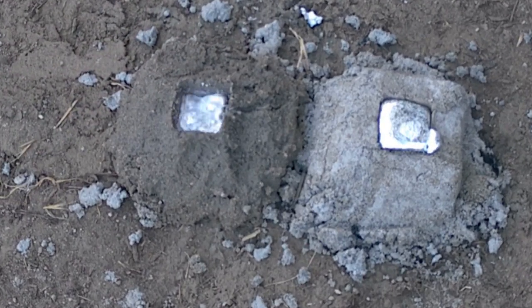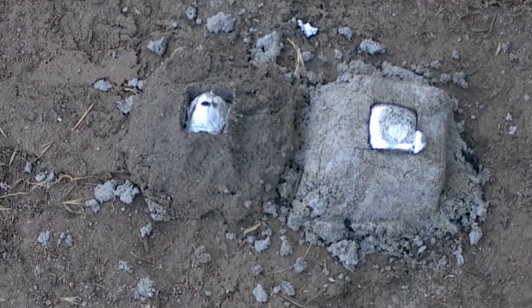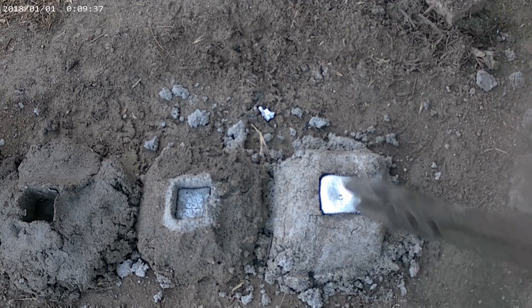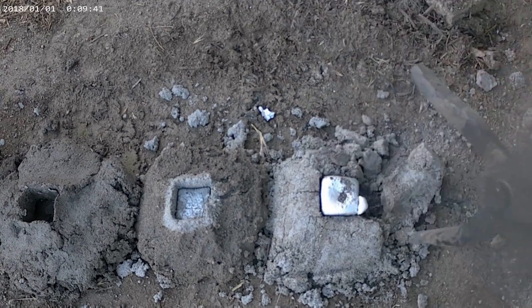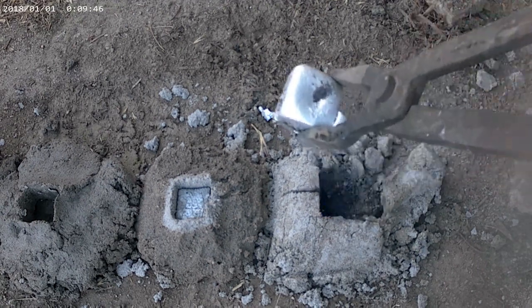Because it's such a heavy clay mixture, it retains moisture for a lot longer. You can see that moisture escaping in the form of steam. Once the hot aluminum vaporizes it, it starts to bubble up through the aluminum. As I'm busting this one out of its dry mold, you can see it's a lot smoother and cleaner from the mold that had dried two days straight.